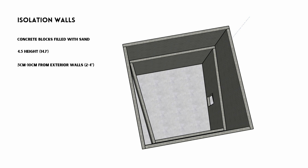These block walls in his design go up to 4.5 meters, about 14.7 feet tall, because going up to the full 26 feet would add a ton of cost. Most of us don't even have 15 feet to work with, which is really what sets apart the pros from amateurs building home studios. But don't get discouraged — we're just going to learn from this as we go and try to apply it to our own home studios. He also angled two of the concrete block walls on the sides by about five degrees, which I've replicated in my SketchUp design.